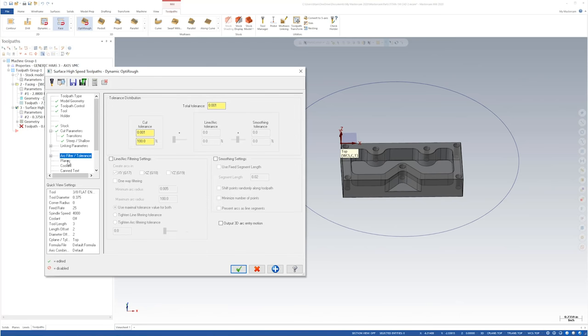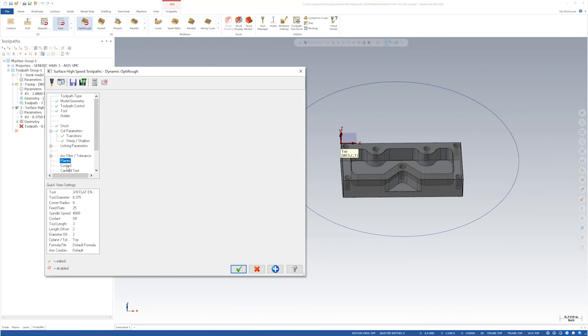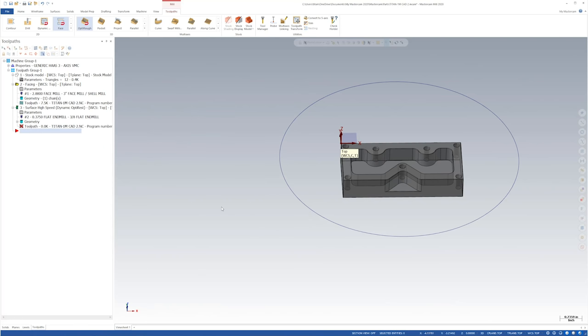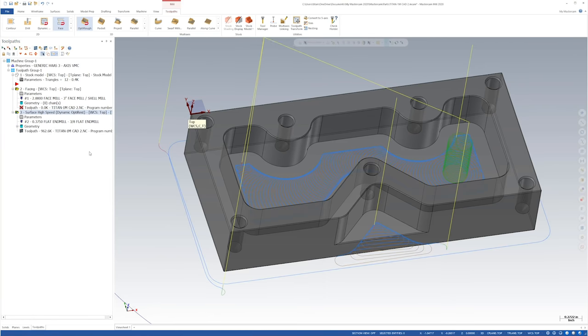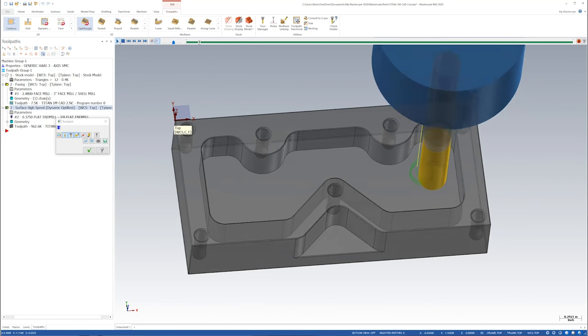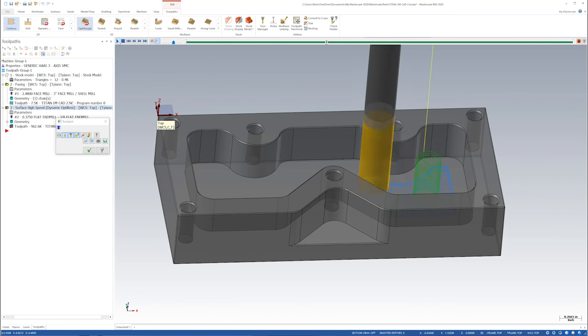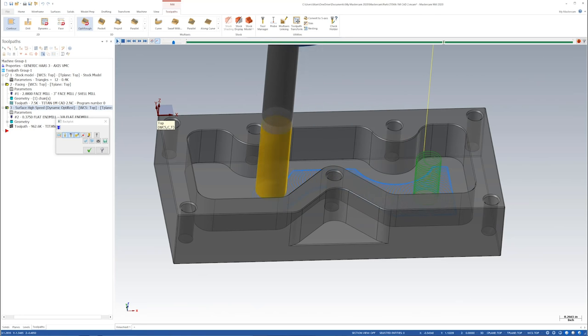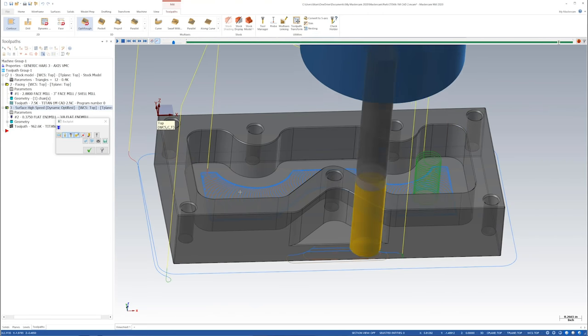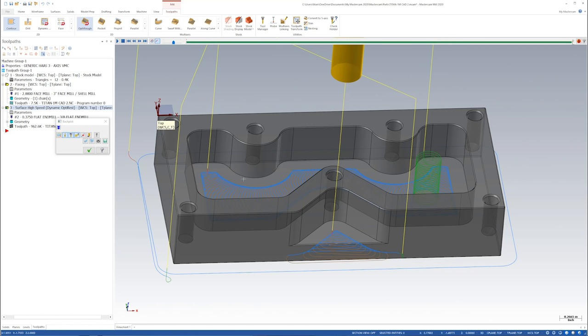Now we'll go to linking parameters. I'll leave clearance at two inches — absolute full retract every single time. I'm going to drop down: 25 vertical entry, 75, 75, 75, 75 — all looks perfect. Ramp height 100. Then I'll turn coolant on and try out the path. This path looks absolutely fantastic. I'm going to go ahead and back plot it — toolpath looks really good. When you have a lot of experience, depending on the type of tool, these step overs at about 15% can be increased depending on your depth of cut and the ability of your end mill. 15% was just safe, and therefore that's the number I used.